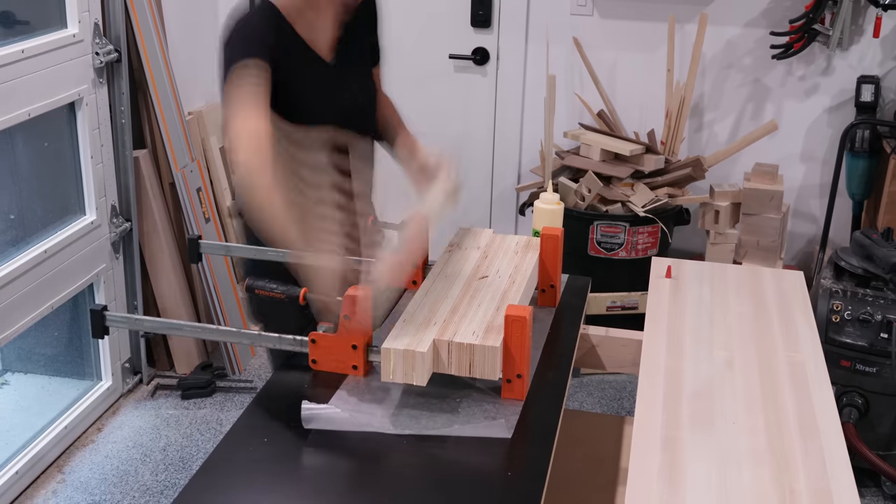It's just a matter of taking multiple passes, lowering the router after each pass until you get to the desired depth. After getting that first line to final depth I adjust the fence over about a quarter inch to make the next cut, and keep doing this — adjust fence, cut, lower bit multiple times, adjust fence again — until I get to the hard stop that I double-side-taped to the underside. That's the final pass and it's a perfect fit.